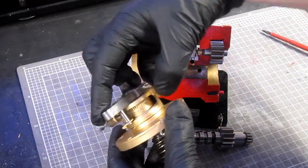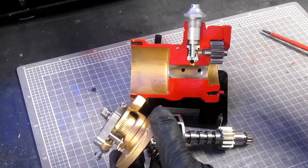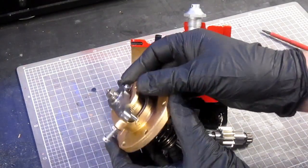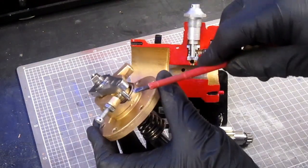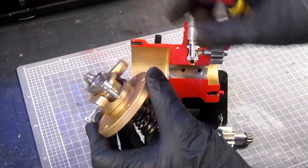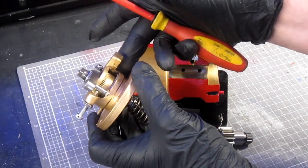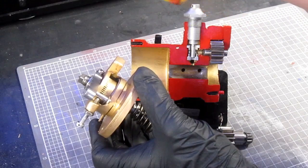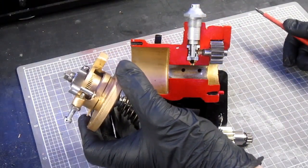This lever here is connected via a cable to the blue pitch change lever in the cockpit. In a multi-engine aircraft, if the cable were to break, because we have this tension spring here, that tension spring would ensure that lever would go back to that position, providing you with the coarsest possible pitch available in that multi-engine aircraft.